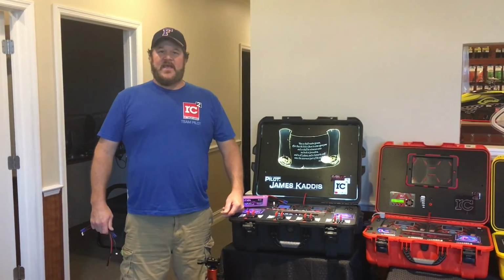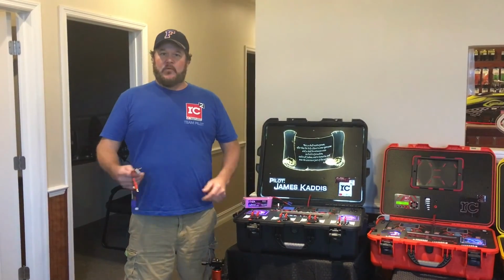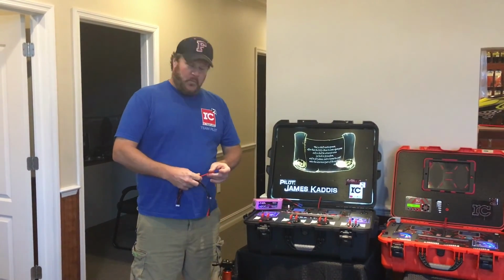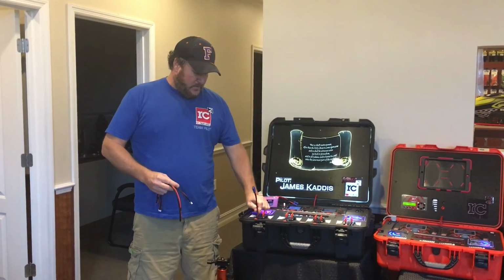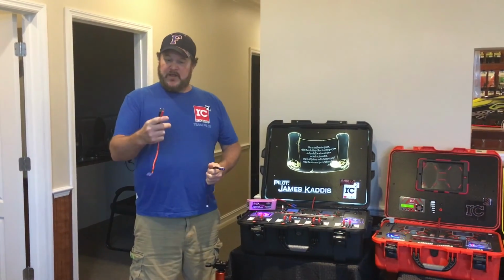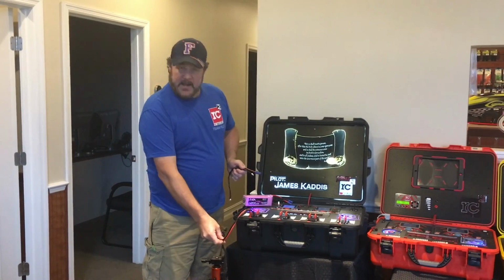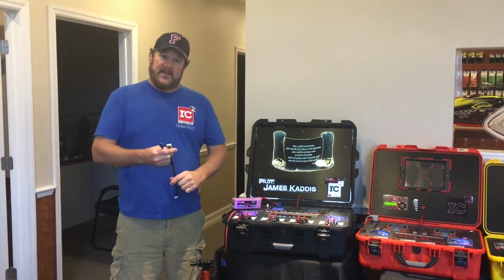Now that we've got James's case into a point where it's ready to ship, we've got all our testing done. Now we're just going to show you a couple of the extras that we put in this case. Now this is a Deans to an EC5, and we sell these cables. Basically, he can charge his LiPos off of a Deans connector to an EC5. He can plug in banana jacks to an EC5. And then he can actually have long extensions off of either one instead of trying to cram everything up on the deck.